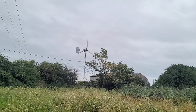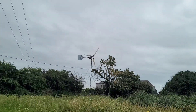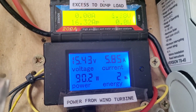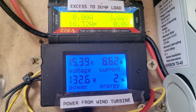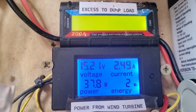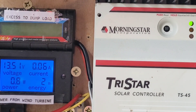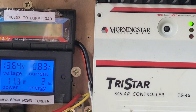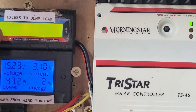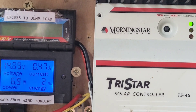Right, we're definitely getting something at this speed. I'll just show you how fast the turbine's going. So it's definitely working. I'm gonna leave it on record for a few minutes and we'll see what we get, because we've only got a mighty sum of 2 watts at the moment. And remember if this jumps into life — which it is doing now — it means that there's something going to the dump load, or that it's definitely thinking about sending it to the dump load.